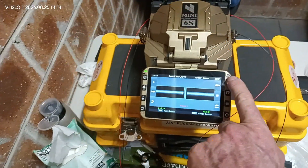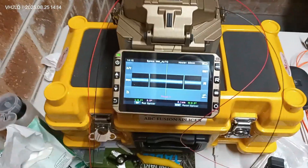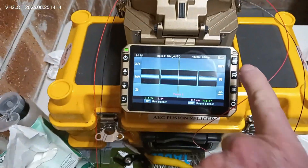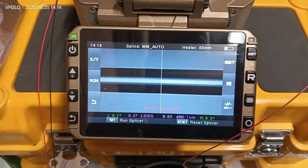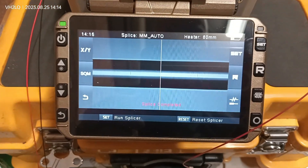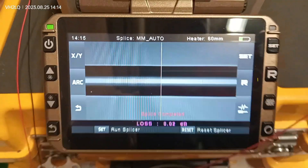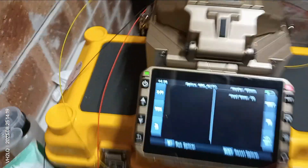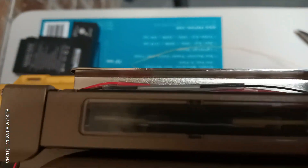It's a little bit hard to do one-handed, so we've got it all set up and we're just doing the fusion splice now. I like to do mine in stages — some people like to just set order and do the whole lot, but I like to view each process as we do it. You can see we've got a good clean splice and a 0.02 dB loss, which is average for multi-mode 62.5 micron fibre. We've just dropped it into the oven — we've got 11 more to do.